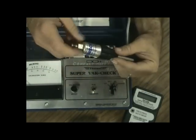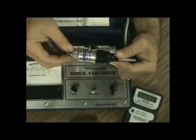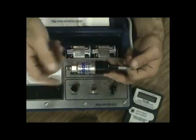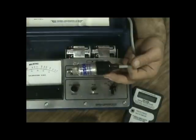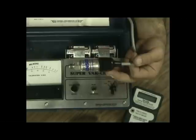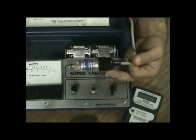In the past couple of years we've seen a resurgence of vacuum gauges going back to the old Thermal style — a thermistor on a wire coming back to a head unit. Yellow Jacket has a couple, JB has the new DV-40. One of the Yellow Jackets at least has a calibration number stamped on it that you plug into the unit when you first put it on. They don't give you temperature compensation or battery-drift recalibration, but if they reference voltage and have temperature compensation built in, entering a stamped number is at least a step in the right direction — you know it's been calibrated to that number at some point.